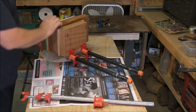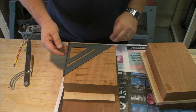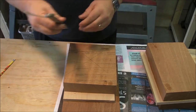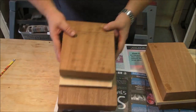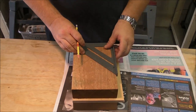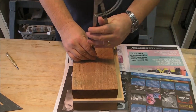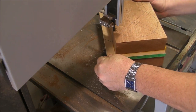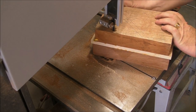We are going to begin by removing all the clamps, and then tracing where we're going to have the centers for our pieces. This piece has a crack so it's gonna affect the shape a little bit — not a lot. Once we have the circles we can go to the bandsaw. There is no trick here — just let the tool do its work.